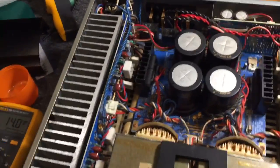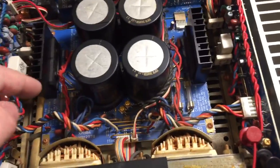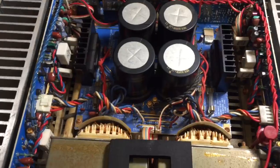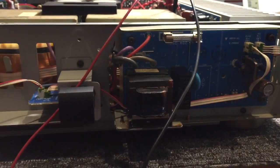So nothing had blown. I'm testing this thinking, what is going on? There's voltage on the inlet side and yet I'm not seeing any secondary voltages. I just couldn't figure it out for about a good hour or so. But then after looking at the schematic, I found we have a little soft start circuit, and it made sense.